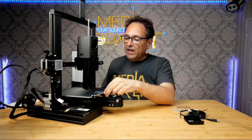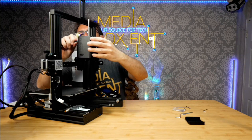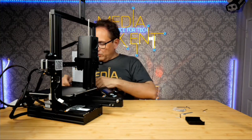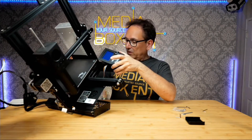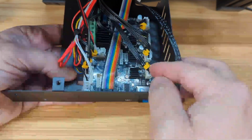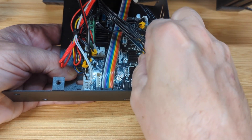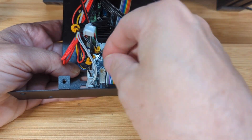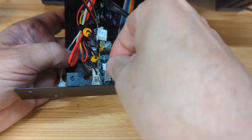Next we need to plug into the motherboard. Remove the cover — there are two screws here, one screw there, and one screw there. Then plug the cable in on the back — it only goes one way. Route the cable so it has slack, since it needs to move up and down. Send it underneath. Now we remove the E-connector Molex connector from the original extruder and plug in the Lucky Bot's connector in its place. Then plug in the thermistor — just plug that small thermistor right in. Close it down and we're ready to start printing.